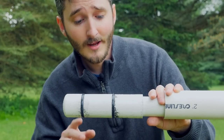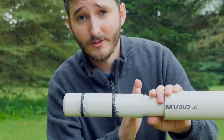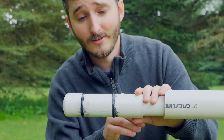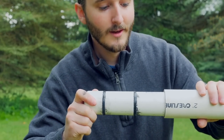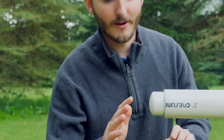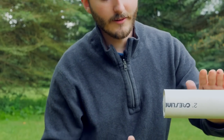I made one small change to the piston design: I added another section — another one-and-a-quarter inch diameter coupling — with a second o-ring sandwiched into it. That just allows this to make an extra tight seal so it can pull a very strong vacuum without any leaks.